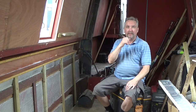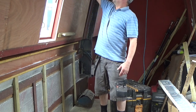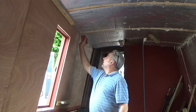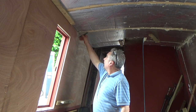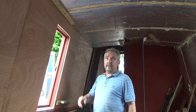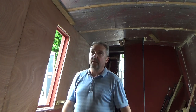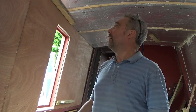About 9 metres of it I've done, I think, so it's probably halfway down. And that'll leave a gap at the side like that, and then we'll be building. When the ceiling panel's on, I think it leaves 100mm, so 4 inches there, so it'll run to there. And what I'm going to do here is have a panel on an angle like that, all the way down, and then the lights will be cut into that, and all the wiring for that will be running there, so it's all in one place. Everything's in that, and that makes sense to me. So if you need to get at it, you can. Plus you've not got wires coming up and down walls, it's just a nonsense, you know.